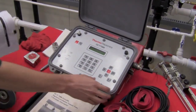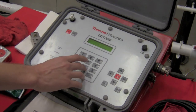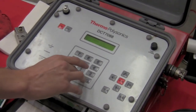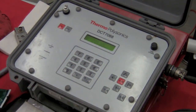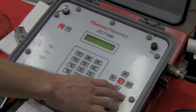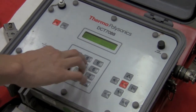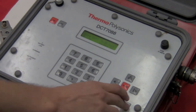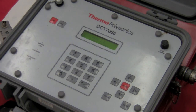We're going to start by going into menu number 10. Press the menu button, then one zero, and then type in 2.375 and press enter. That's the OD of our 2-inch PVC Schedule 40 pipe. Then menu 11 — that's going to take us to wall thickness — and type in 0.154, then press enter. Then come to menu 12, and it will have already calculated the pipe ID for you. You need two of three out of pipe OD, wall thickness, and pipe ID, and it'll calculate the final one for you.